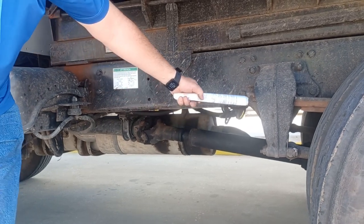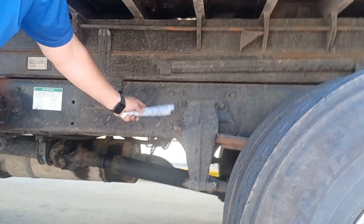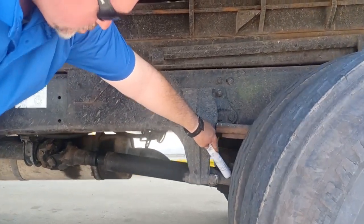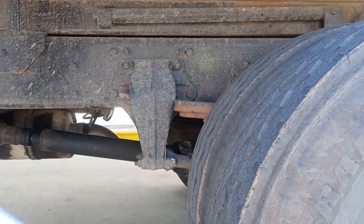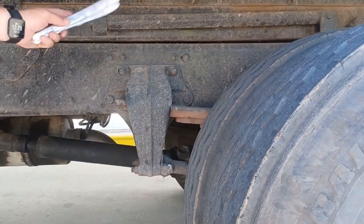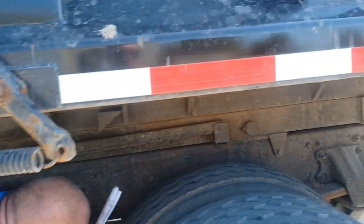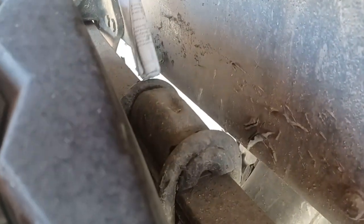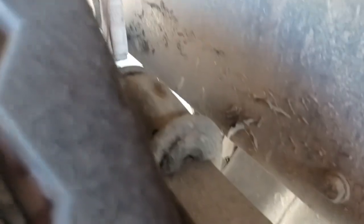Moving our way back, we have a spring ride suspension in the back as well. We have a front spring hanger, our springs, and what's called a torque bar — arms are adjustable, bars are not. This one is a torque bar on this side and on that side. Moving our way back inside here, we have two U-bolts on this axle. We're going to check those U-bolts the same way we checked the ones up front — make sure they're not stretched or cracked, and make sure all four nuts are on the bottom of the U-bolts.